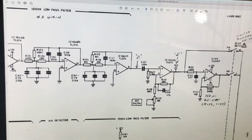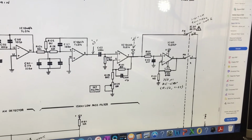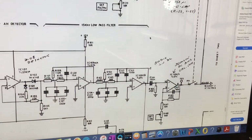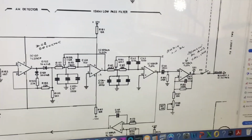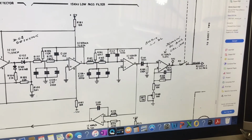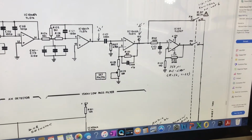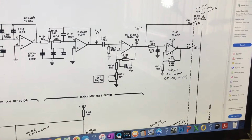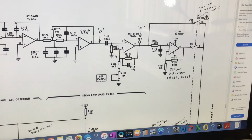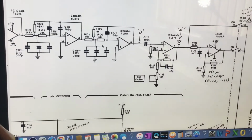The FM at the top, the audio signal is amplified and passed through to these audio switches for AM and for FM and phase mod, and then likewise for AM, the signal after it's been detected and the audio recovered is then fed out here. Now what I did, I went on to test point 2 here to see if we could recover any audio, and there isn't anything. So I started to work my way backwards through the chain all the way back to the starting point.